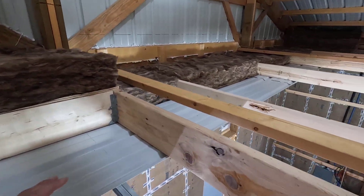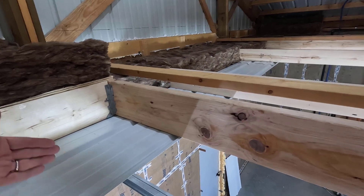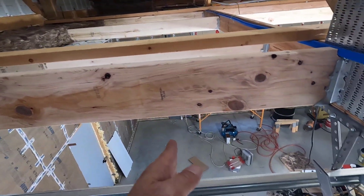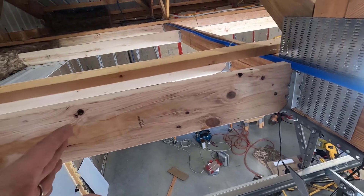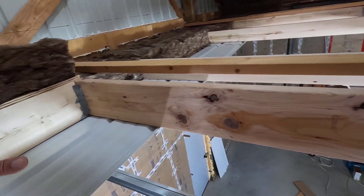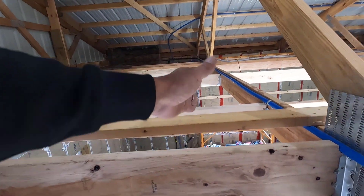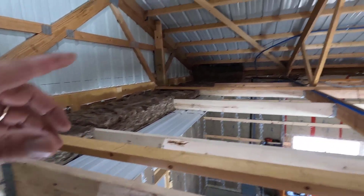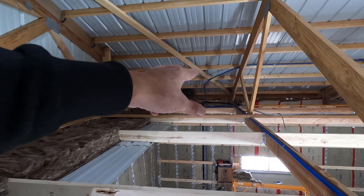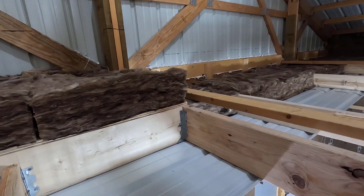You can see yesterday's progress here. With any luck I'll be able to get an entire row in. This next row will bring me to 6 feet, and I'll have about 2 feet left over here. I'll have to get in and put in the insulation from there. Once I get up towards the end I can do it over the truss. It's going to get really tight in the corners, but we'll figure out a way to do it.